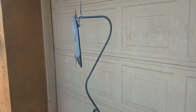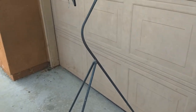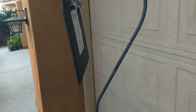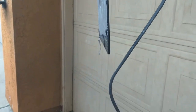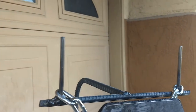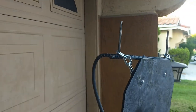Just so you can see what I did: I took some half-inch rebar and built a kind of small pyramid with a very long arm, then bent it back into a double-S and brought it back parallel to the deck. That put the weight of the plate pretty much over the center of the stand. Then using just two quarter-inch steel pins, I gave myself a hanging point.